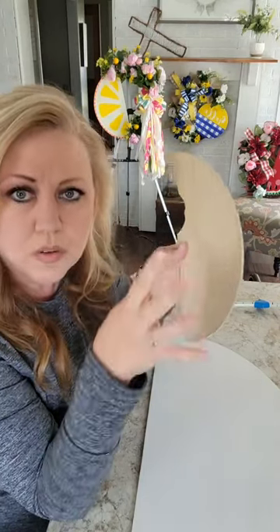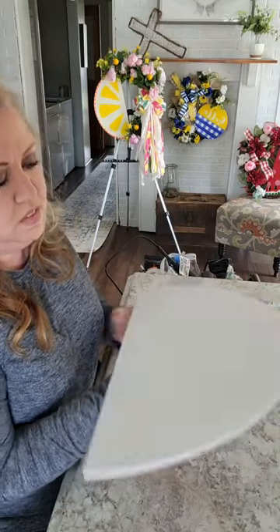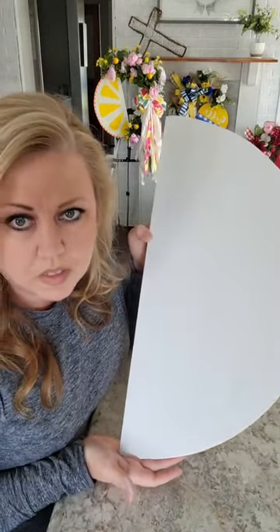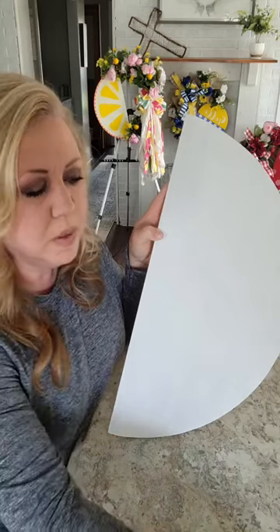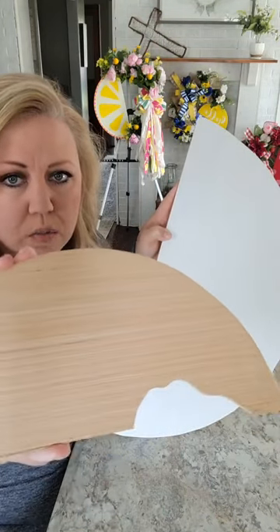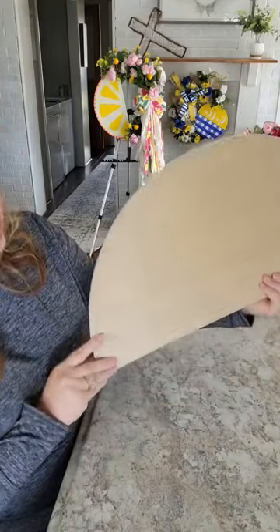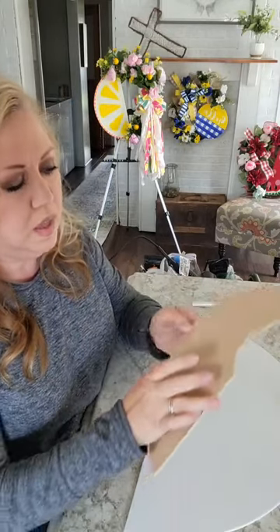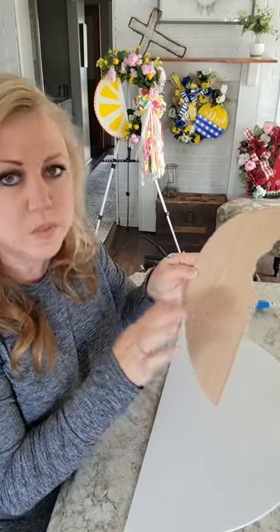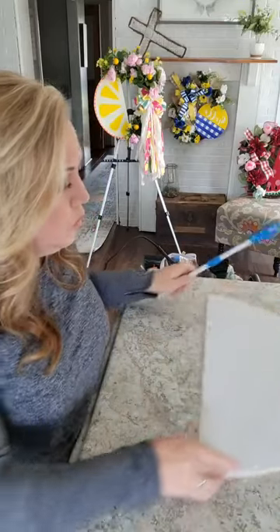I've seen some that are a little thicker and heavier, which means they'll be that much wider too. When you cut it — this side is obviously white and takes forever to paint — I went ahead and applied three coats of white because white is just a little challenging. You can see this side is more orangey and this side is lighter. The orange side is the side you always want to paint, so I've got the lighter side on the back. When cutting, you want to sand the orangey side the best because that's what your paint actually attaches to.